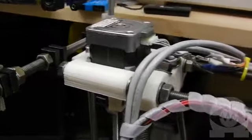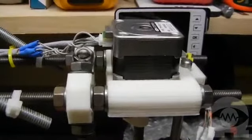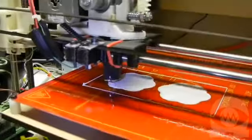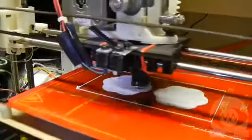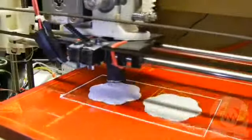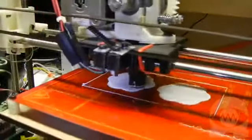The Z-axis has two motors and no belt at all. They turn two long threaded rods called lead screws and need to lift both ends at the same time against gravity. Using two motors is more powerful and actually simpler than using only one motor with a belt. This is one of the major differences between the Prusa design and previous RepRap models.